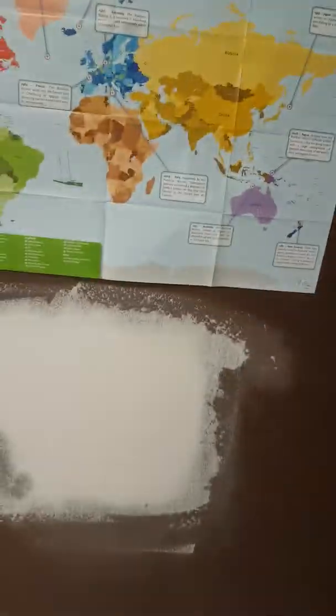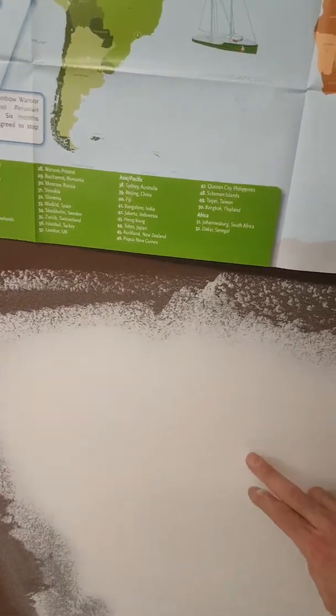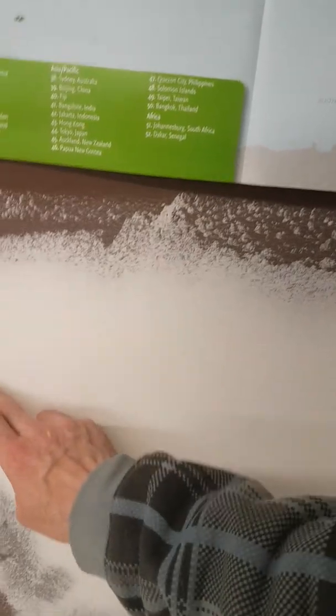There were some serious holes, and while I was going to be painting this, I filled all the nail holes that were in here as well — didn't take much more time. On the back section here, there's just the one door and the dent that was made in the door. This drywall patch ended up being a little bit bigger because I had to put some fiber tape over the hole and then extend it with the first coat and ultimately smooth it out. That's why the patches need to be a little bit bigger when performed, so that they actually level and smooth out.